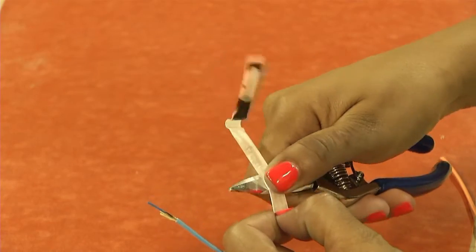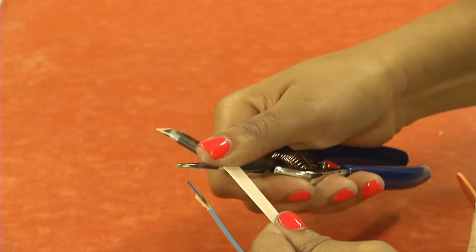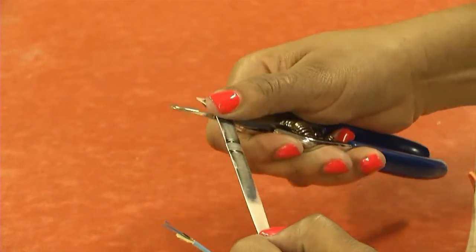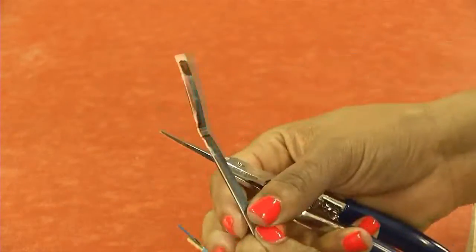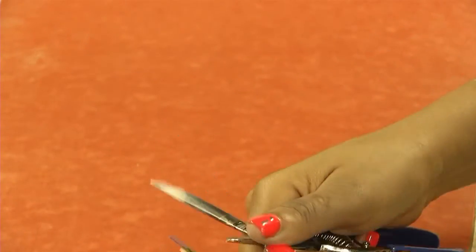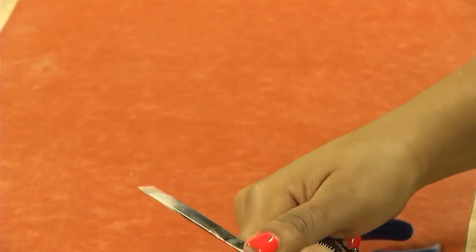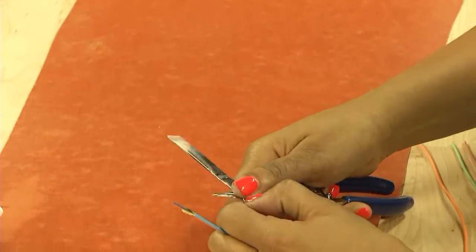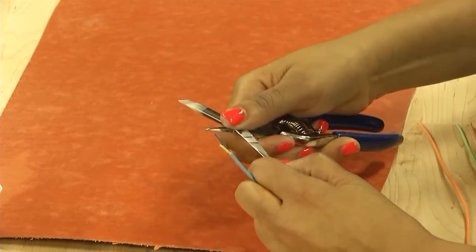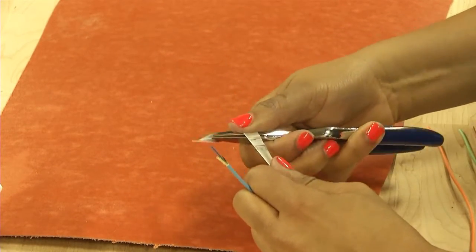After inspecting the connector and verifying that the ferrule hole is clear of dirt, begin mixing the epoxy. The epoxy is a two-part mixture that is gently mixed by running the fingers over the sealed tube. Continue mixing until the epoxy is a smooth, even color. Do not introduce large air bubbles into the epoxy during the mixing process. Large air bubbles can lead to connector failure during temperature extremes.